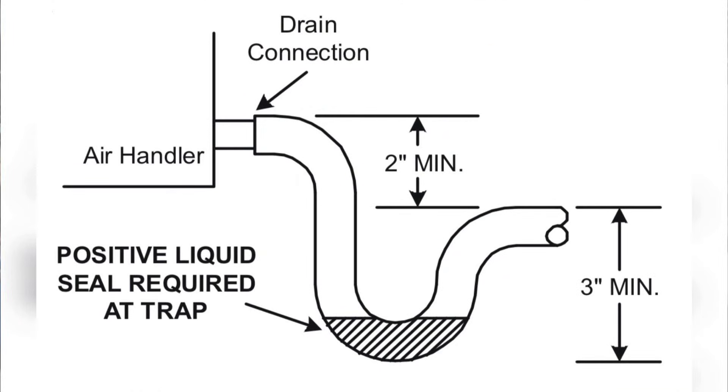Now I'm looking at a picture from an installation manual — I think for Goodman — showing a P-trap coming off an air handler, and it has some key points to adhere to. First, the drain pipe going into the P-trap is two inches higher than where it exits the trap — that's important, because a running trap doesn't function properly. The entire time a system is running, negative static pressure is pulling on that water in the trap. This diagram shows a three-inch minimum depth, which is deep enough to overcome negative pressure issues. And if there are airflow problems with high return-side static, the pressure inside the P-trap will be even higher.